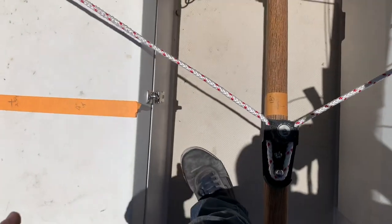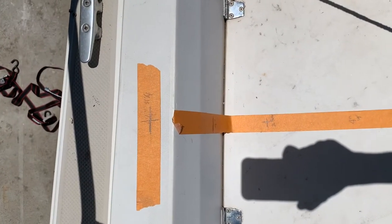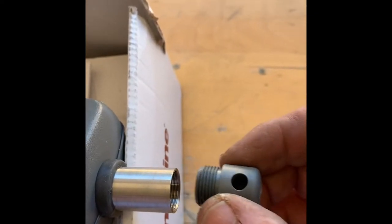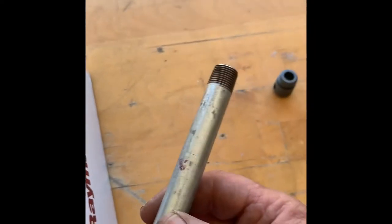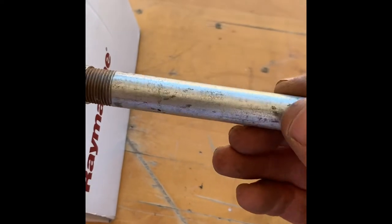I came out perpendicular to the tiller to find this spot, which I measure at 31 and a quarter inches. All I need is an extension for the tiller part here — this actually unscrews. Ray Marine sells the extension for about 50 bucks to bring it out the eight inches I need to make up that distance. But I just happen to have this piece of galvanized pipe with a three-eighth thread, and I tried it out — lo and behold, it fits.